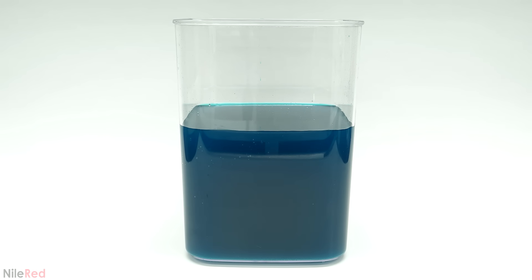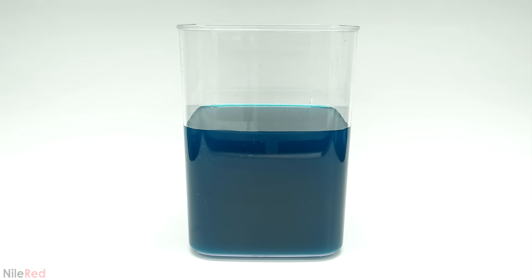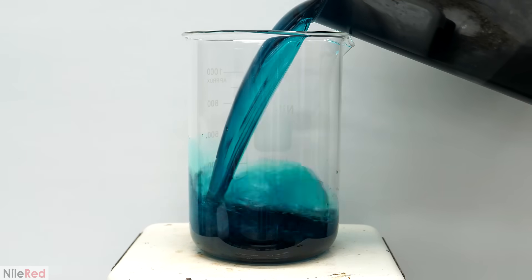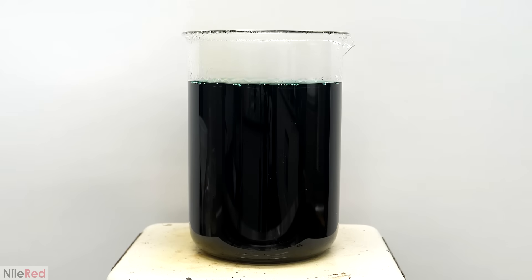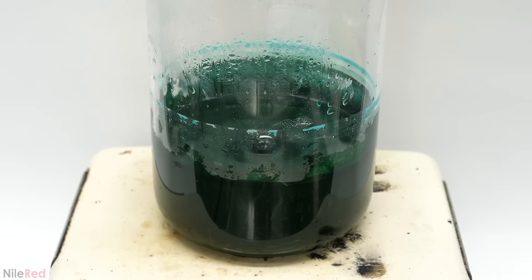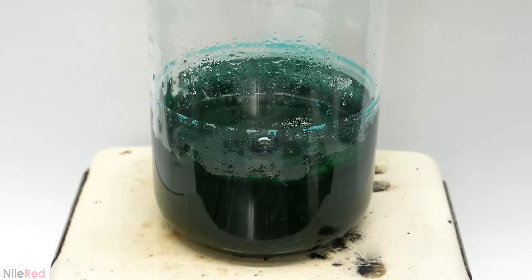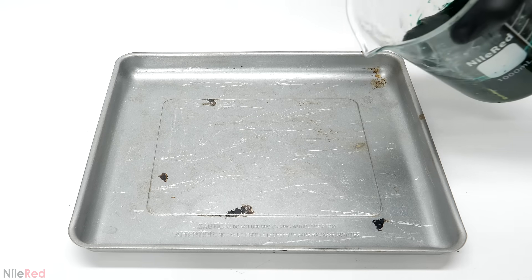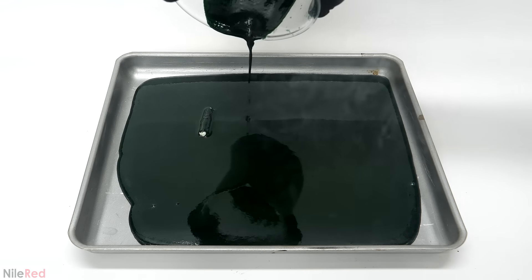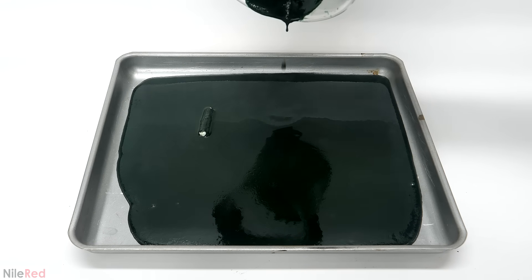This wasn't the end of it though, because I still had a whole bucket of acid to deal with. The major contents were copper salts as well as hydrochloric acid and nitric acid. The first thing I wanted to do was reduce the volume, so I let it sit out for several days to evaporate. About a week later it had lost quite a bit but it was extremely slow, so instead I poured as much as I could into a beaker and cranked up the heat, with a fan off-screen to blow over the top and speed things up. One thing to mention about this whole process is that it's really dangerous — a lot of acid vapor is released. I did this in a fume hood so it was fine, but I really don't recommend doing it.